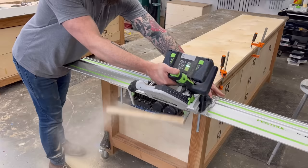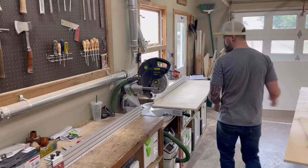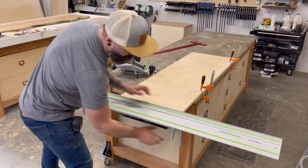The best way to do that is to cut one piece for the top and bottom together and then cut it in half after we cut our dados — that way they'll all be lined up without having to get super precise. So after ripping a piece that is twice as wide as I need, I get out my track saw and cut a 45-degree angle on one side, then flip it over to do the same on the other side for a mitered box.